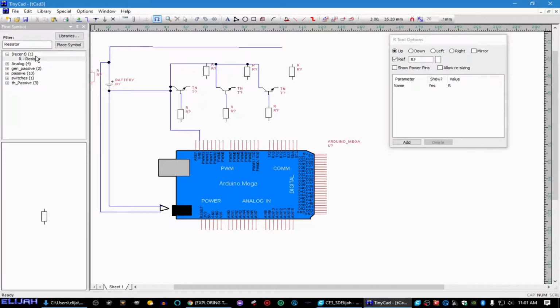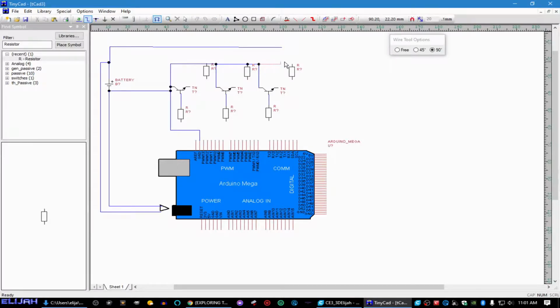And then I'm just going to use one resistor, but there's one LED for this line, because what's going to happen is we're going to have multiple LEDs, but they're going to be different colors, obviously. They're going to be three color LEDs, and they're all going to be in parallel. So each LED is going to have this setup on it.